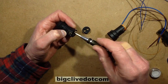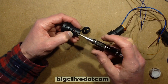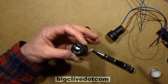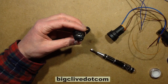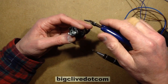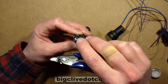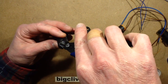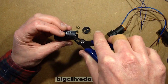And when you do that, even if you take them out, I was expecting, oh, I just got a little tingle off that. That's because it doesn't have a discharge resistor. Let's make sure I don't get another tingle off that, shall we? I think I've already just discharged it through me. So the leads, these are sort of two pressed-in bits of metal, and they've got the two leads coming up from down below. I'm not sure how easy it's going to be to disconnect those.